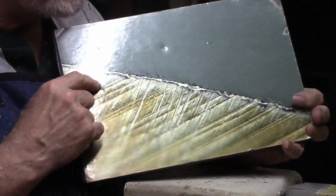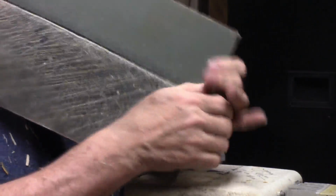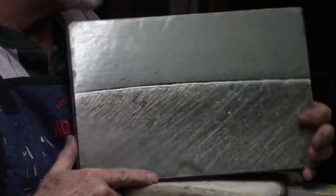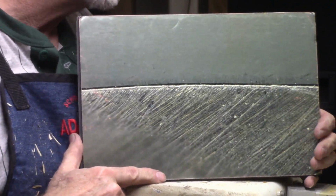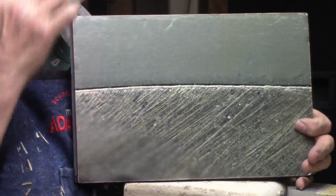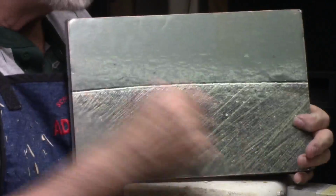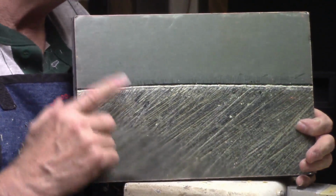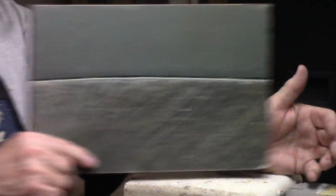I only use this to start with, where I'm going to rough with, but this is what I use. And it's in all the old books. You find it in books in the 19th century. Frank Payne talks about it. It's a burnish burr, not a burr off the grinder. That's where you start, but we burnish the burrs. And we control the size of the burr and the types of burrs by how much pressure we use. Can't do that with a grinder, turns out. So a burnish burr, and what I use as the burnisher is a piece of carbide.